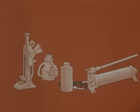To prepare to move a load, it is usually necessary to raise the load high enough to place skids, rollers, or dollies in place. On heavy loads, this is usually done by the use of jacks. There are normally several types of jacks available to the rigger. The ratchet, screw, or hydraulic type are the most often used.